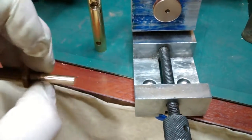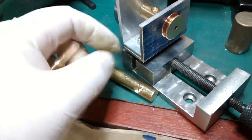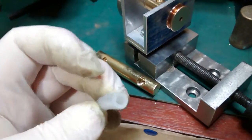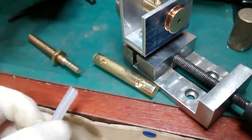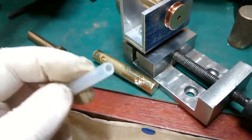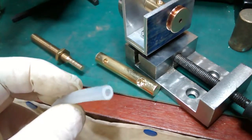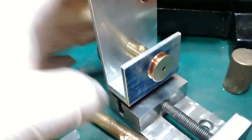I'll make a little pipe that fits into that hole and it'll come out through here. The block will be held onto the frame with a screw, and that will allow me to attach a 6mm outer diameter silicone tube with a 4mm inner diameter — it's just a nice push fit for that at the moment. This is food-grade stuff; it's used in Coca-Cola machines, vending machines, milk parlours etc. It can withstand something like 240 degrees, so that's enough to run steam through.